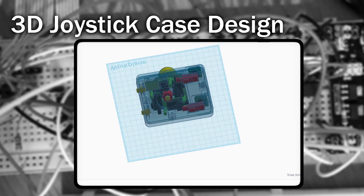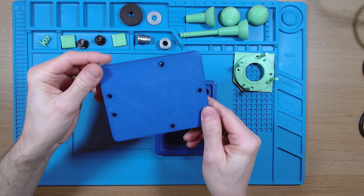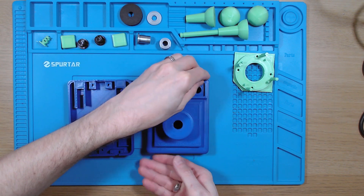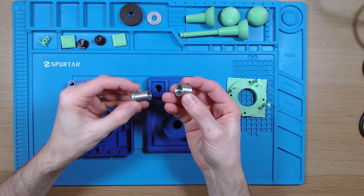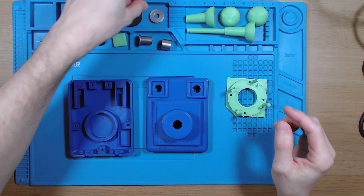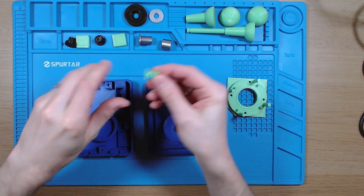So I'm hoping everything's going to be okay and I'm now off to start printing. I'll be printing this using PLA. So everything's finished printing. We've got the base bit here and the top half. It took a while to remove all the support material but once it's done it's not too bad. Then we've got the piece that we're going to attach the four micro switches to for the directionals, the shaft for the joystick, a little collar that fits on the top, the little piece that has a special separator, the actual fire buttons, and lastly the cord grip.